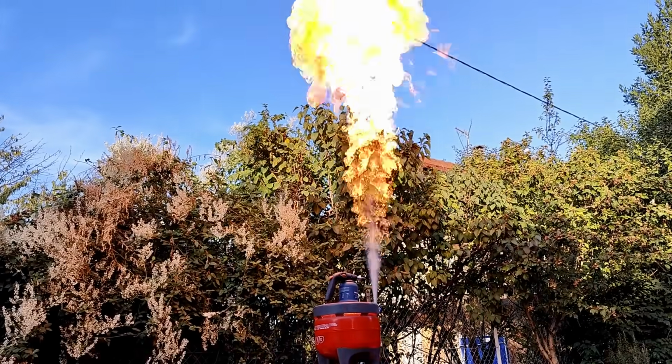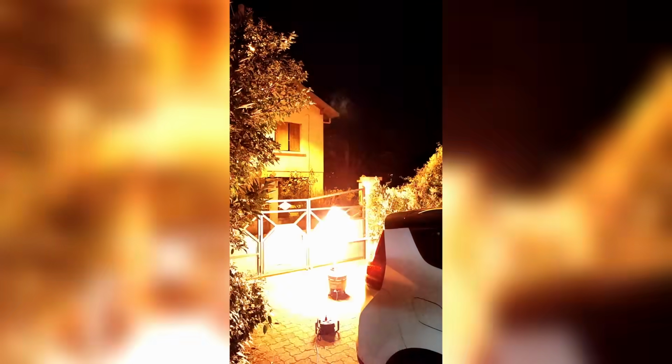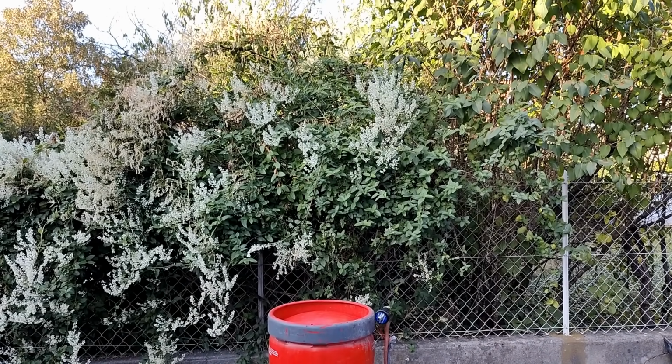However, I noticed something quite annoying. Once the initial burst from the butane stored inside the tube was gone, the remaining flame was still much smaller than I would have liked. So it turns out that these particular butane tanks unfortunately have a flow limiter built inside of them. But luckily I came up with a cheeky hack to bypass this limiter.